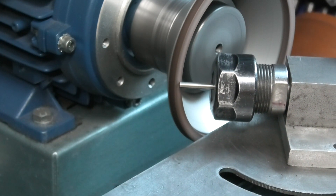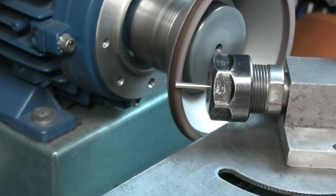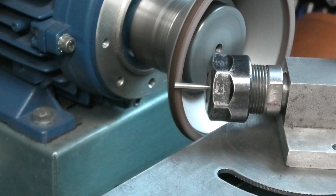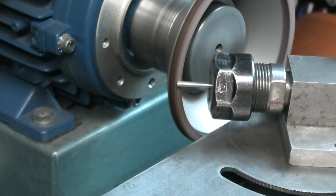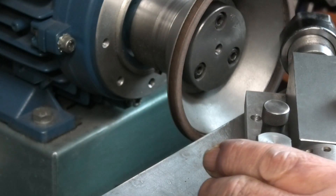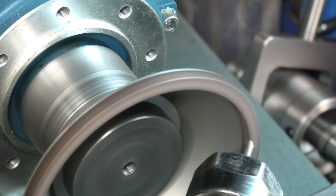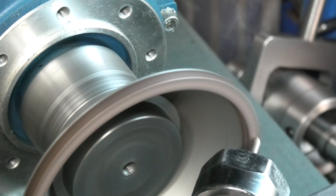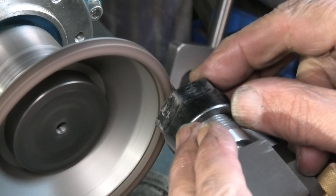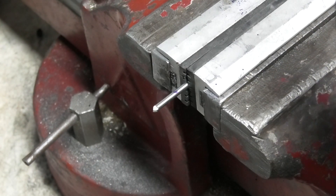So now I can make the tool bits to go in this. I'll place some of the tool steel in the cutter grinder and grind one of the boring bar tools. I'm cutting a 45 and a half degree angle on each side, then I'll do the top and then put the flat on the side of the tool. Turn it around the other way and set it to 45 and a half degrees. I'm just using the side of the wheel to grind the flat so the ball bearing can locate to lock the tool in position. I've ground the point — now I just need to cut the steel off the bar.